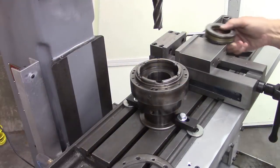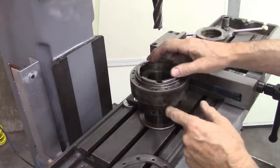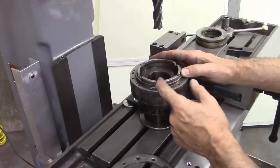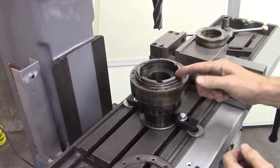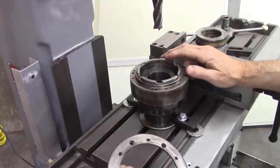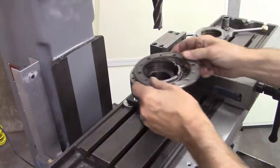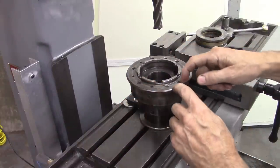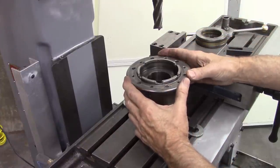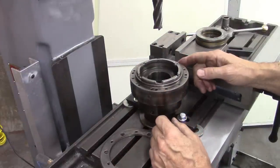Okay, this pulley right here is a two-piece pulley, and this section right in here is supposed to lift out, and I cannot get it out. But I don't have to remove it, and I may just leave it in there. But somebody's damaged it. It looked like they knocked out sections of it, in roughly six spots around there, semi-evenly spaced. And, well, this indexing ring was bolted to here. It looks like it's been bolted several times. But I think they were using the six hole or six position indexing holes to lock the spindle when they removed the collet. And over the years, it totally destroyed the ring and the pin that you saw previously and the hole that it goes through.